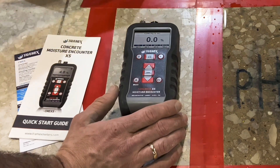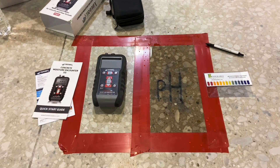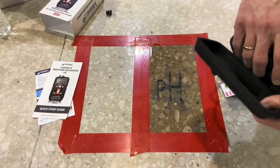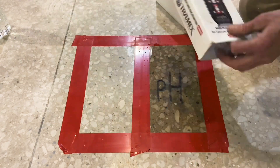This reading will vary by time of year. This particular slab in the summer is over three percent; in the spring it's less than three percent. This gives an idea of the pH of the surface when fully saturated with water, while the moisture content is tested in a dry state to show what its current condition is.